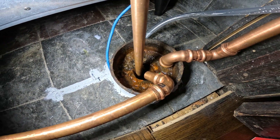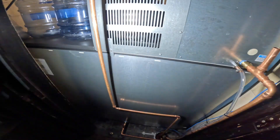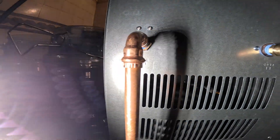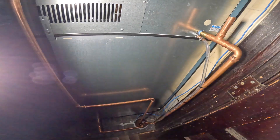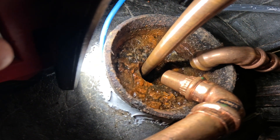Right now, I have to power off the machine. The water is actually still open, but for safety purposes you could turn it off. There's a water regulating valve in here that's actually keeping the water closed because the machine is not running, so we're okay to work. The other thing is this area is still wet — you can see a little drip here and there in a few spots.